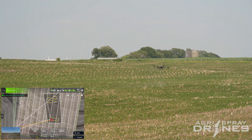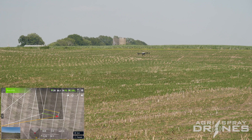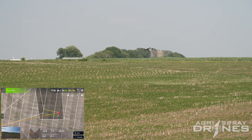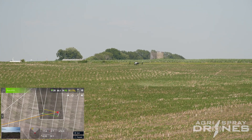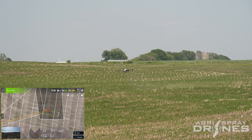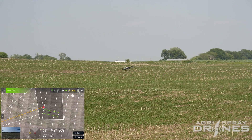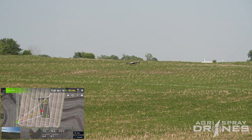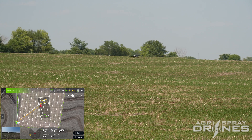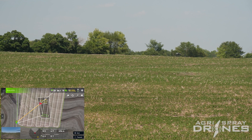There you see it's dropping down to about 10 feet. This is 3D flight route mapping, so it's not using the radar to get its height — it's actually using the map and a point cloud from the pictures it took to do its terrain following. This means you can use this for really steep terrain, not just flat fields. Right now we're flying over terraces and it did a pretty good job mapping the elevation of those terraces. It finished the southern side and it's flying the northern side right now.